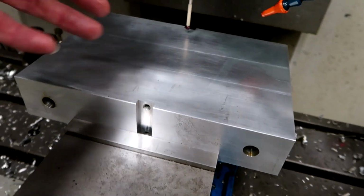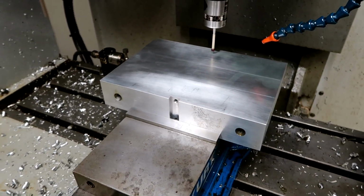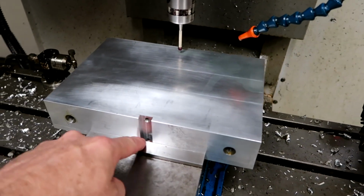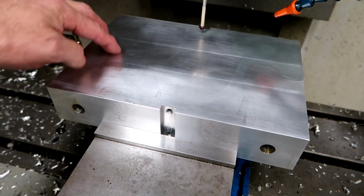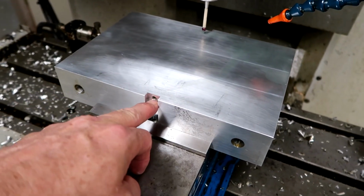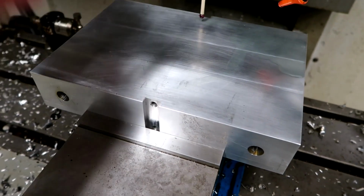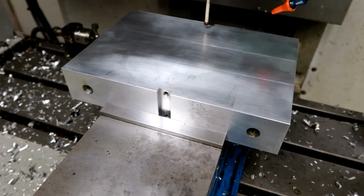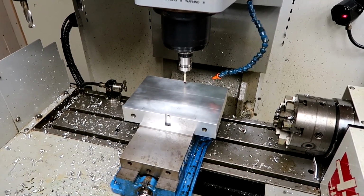I had to run the program again. Both sides of the part are fine, but I had to run it again because the battery went dead on my camera in the middle of trying to film it before, and so it's not going to hurt anything. I think I'll just have to plug these 1/4-20 holes here. The rest of this is going to get all milled away for the rest of the part here in these holes. This is all going to be cut away, kind of like this, like the shape of the part. And so it's not really that big of a deal, but these two holes might end up intersecting. I don't know how far the bore of the bearing, where the bearings go, is, but it really won't make any difference. I'd plug them with something, and it's just a fixture. I wouldn't have done it if it was a customer's part, but in the case of this, it's just a fixture. So that's the setup, and I'm going to show you the probing cycles.